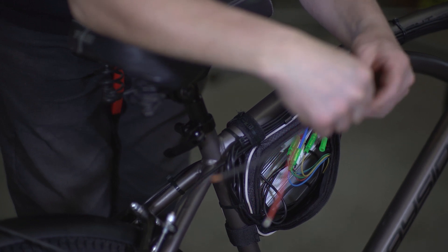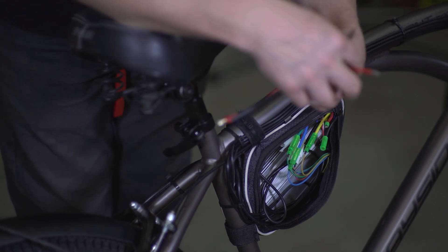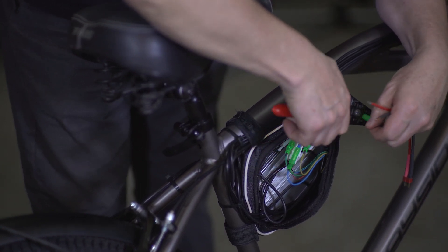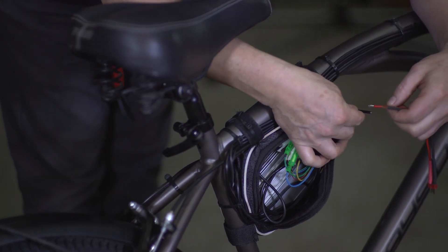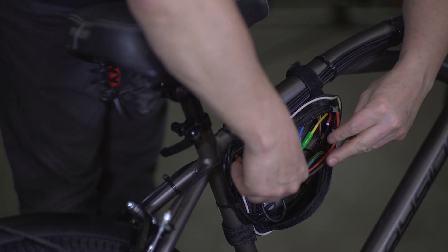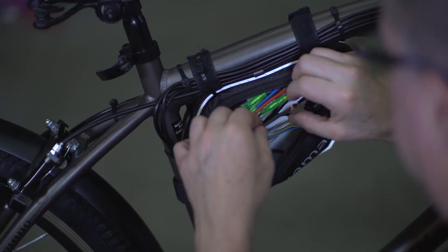Just for safety reasons I feel like I need to have a backup — a way to quickly unplug things if I have to. I'd like to have a connection out in the open so if I just pulled on it, if the batteries did something funny or this was doing something funny, I can just disconnect everything. My solution is to take the positive and negative here, snip those off, do my little trick with the wires where I blend them together, solder them up, and I've got shrink wrap on this side right here so we'll just pull the shrink wrap up and shrink wrap these two together.